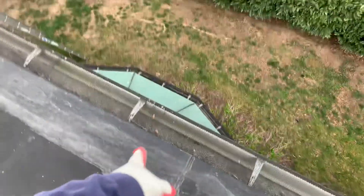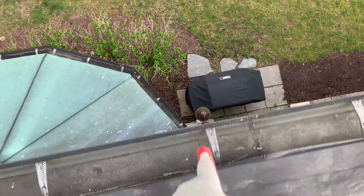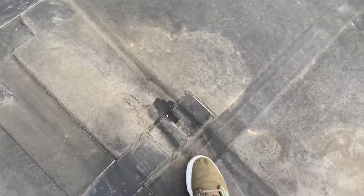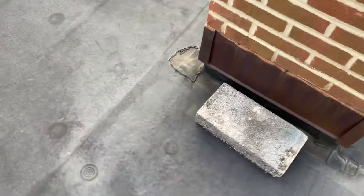So you line up that corner of the bay window — about four feet in is where your leak is. If I come four feet down this roof you can see a big belly here. The roof deck has rotted away and there's nothing there — and it's still wet now even though it hasn't rained in a while. So this depression formed and started to leak. There's a strip of tape there, so that's obviously where the breach is.